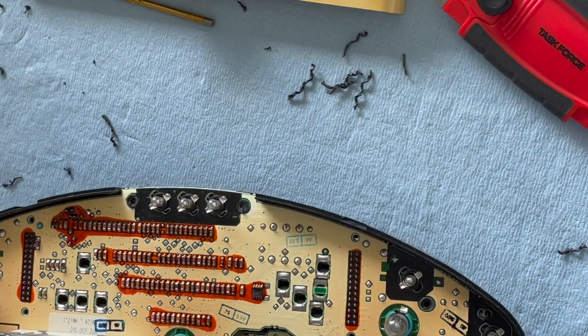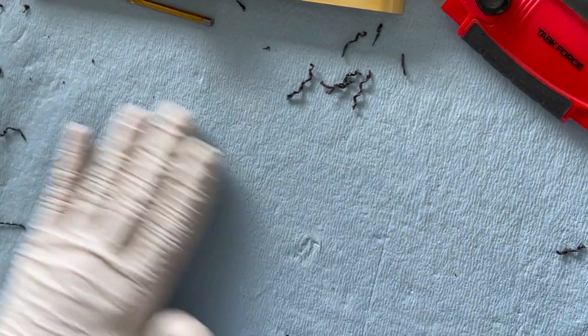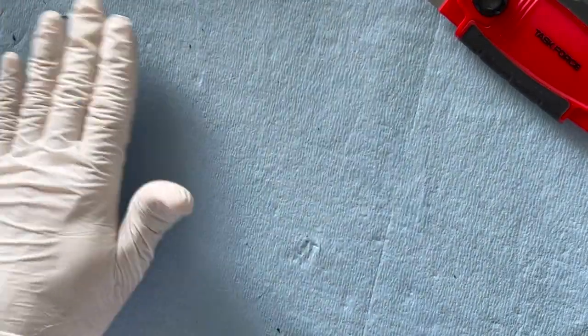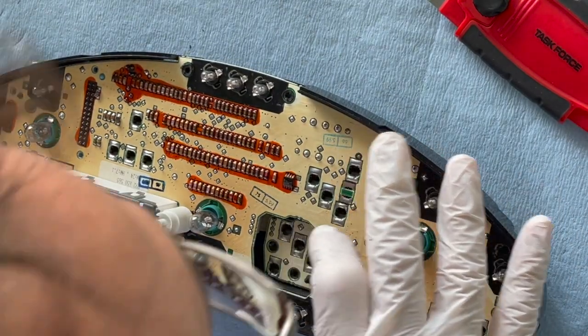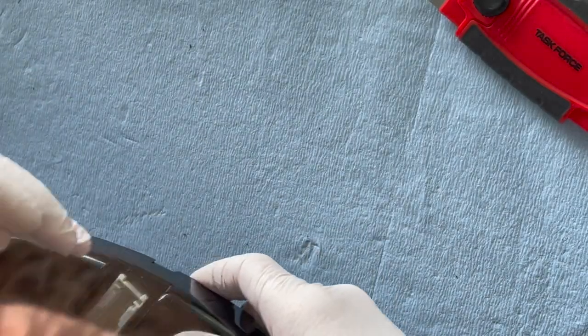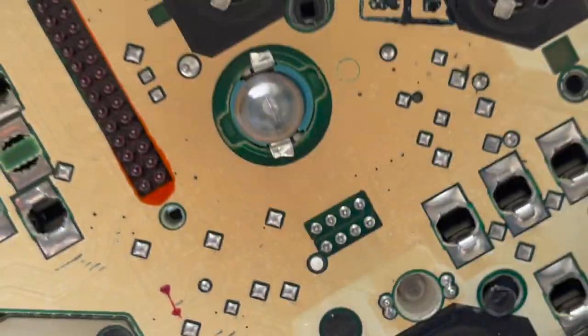You can see that this thing starts moving now. You're going to need to obviously try to keep your bench clean when you work on this. In the end I used a 3/16 of an inch bit — just enough to remove the top portions. Now what you need to do is try to remove these clips. There are clips holding these and you want to take them down, but you can see that this thing is already freely moving, so you're starting to release it from the back.